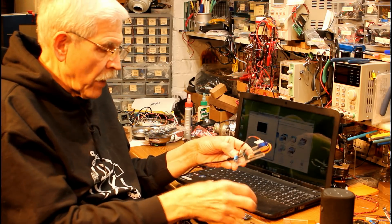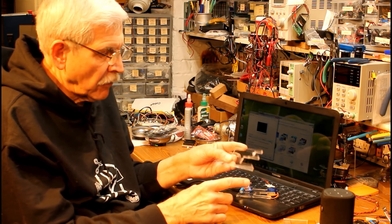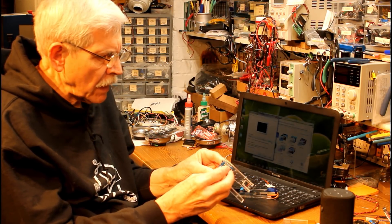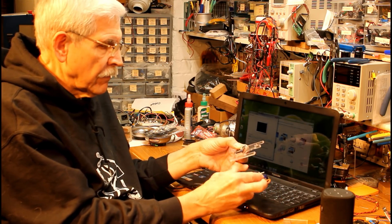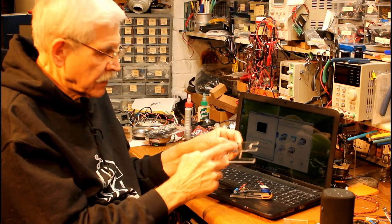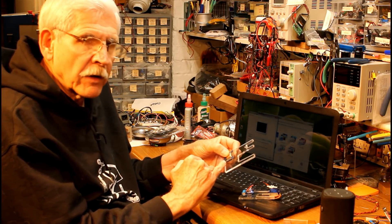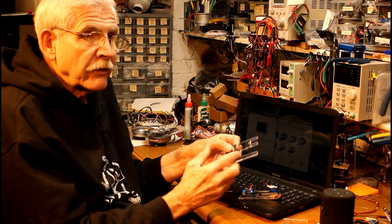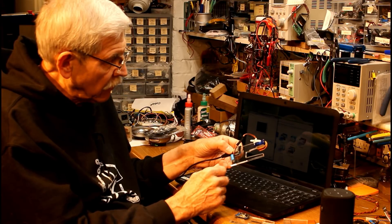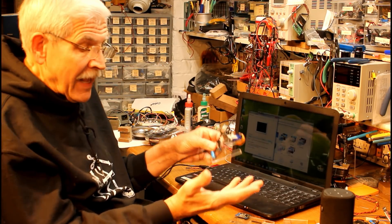How do we put all this together? You need several things. First of all, you need some sort of clamp to hold it to the side of the laptop. I happened to make a design on quarter-inch plexiglass and cut it out with my laser cutter. I put 16 little holes on it, not electrically connected, just to hold the WeMOS. I've got a servo that goes into this little spot that sits over the shift key, controlled by this device. The only other thing I've added is a 3300 microfarad capacitor across the plus 5 and ground pins on the WeMOS — I found the device was crashing every 20 minutes or so, and research indicated other folks cured it by smoothing out the voltage with a large capacitor. For power, I'm just using a USB cable into the side of the laptop.